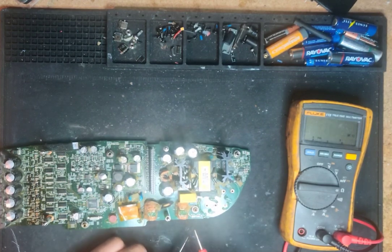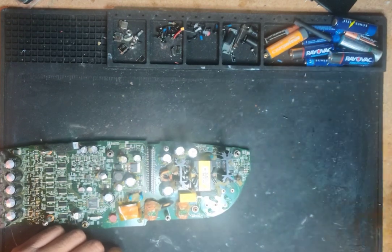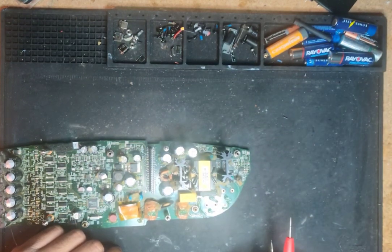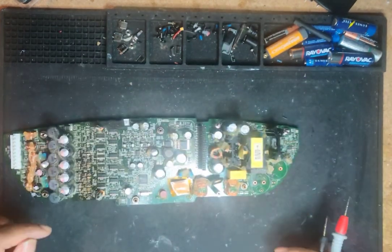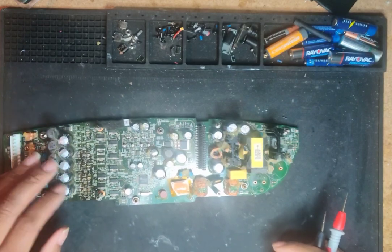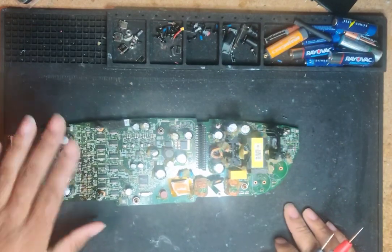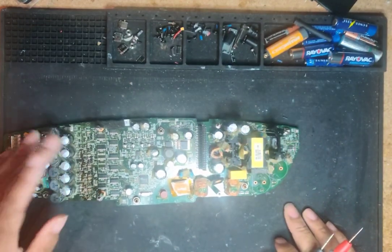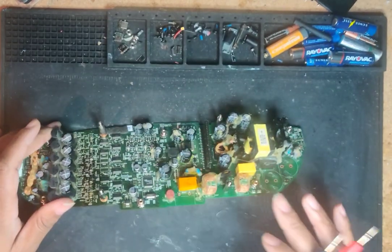That's why I didn't want to gatekeep this information. I at least want to throw something out there to help somebody who's probably running into this problem — before they chuck it in the garbage. Also be aware that if you have one of these, the problem could be something else entirely — nothing to do with the power supply section. It could be the output section with bad caps throughout the board.